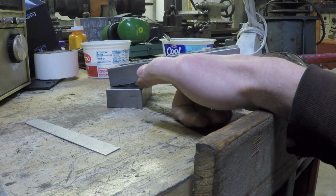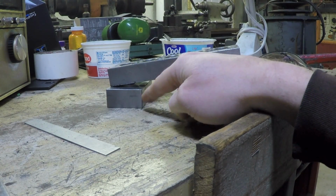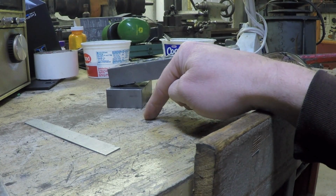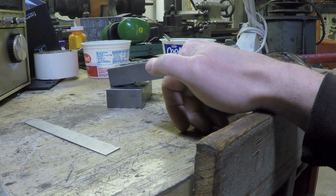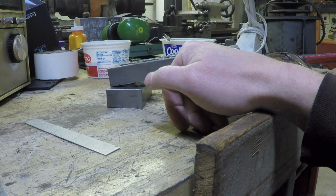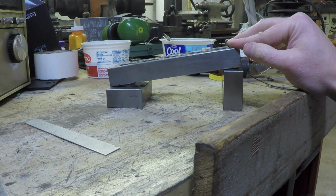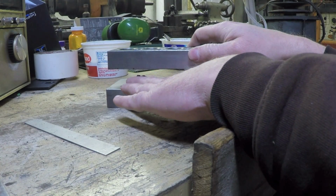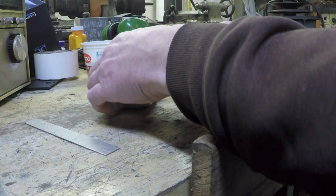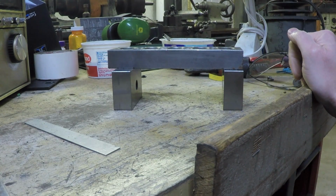The other thing I can do is if I do end up actually shortening that leg by, say, an overall 1/16 of an inch or whatever it ends up being, I can make a plate to sit underneath the leg between the pan and the leg, which will lift it up and effectively eliminate the issue altogether. So in other words, basically put a plate in here to make up this size here and effectively create the situation we started with. So that's an option there.